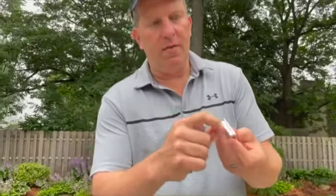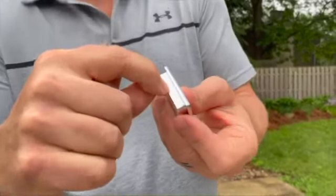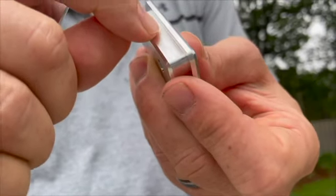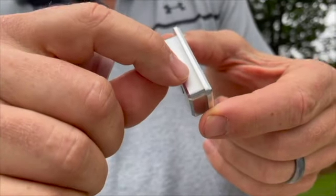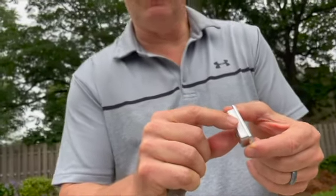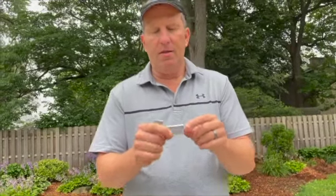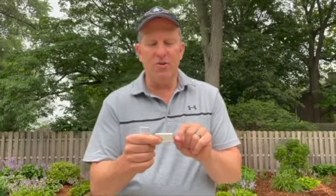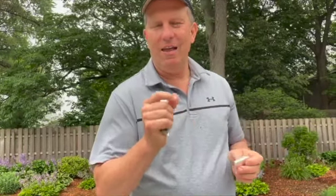If you look carefully, the section along here is where the interference is met. So when it is pushed into the handrail, there is a good place for it to land. It's a slight interference fit so we can move a little bit of aluminum to create that good bond. On the outside, we've got a nice chamfer so it gives a really finished look. Our machining department is very careful to make sure that the radius around this corner is the exact match for the radius of the aluminum extrusion, so that when it's all done, it looks beautiful.